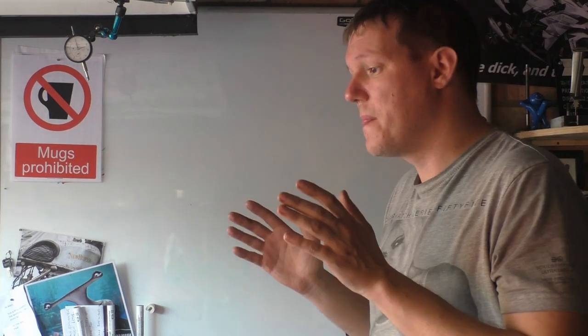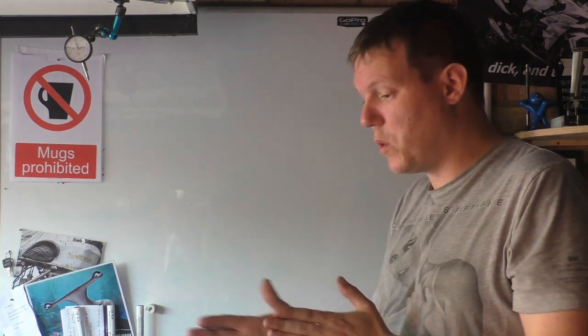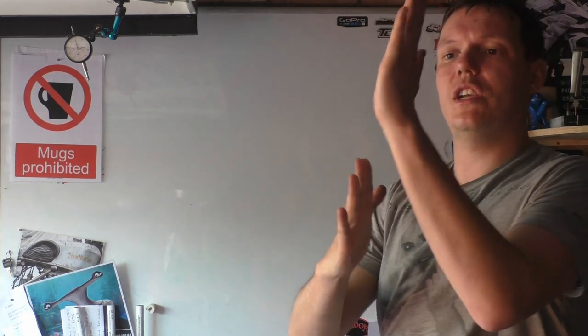Files are extremely hard, and with hardness comes brittleness. You get a file, give it a whack against your vice, it is going to shatter, and it's not much of a whack you need to give it. Don't stick it in a drill, because if that grips too much — and it's tapered — it's going to shatter. You're going to try and push it through with that drill, and it's going to shatter. When it shatters it's going to shear, and your hands are going to go straight into that broken bit. His excuse is, oh I'll just do it really slow and be really careful. Or just get your 8mm drill and fucking open the hole up.